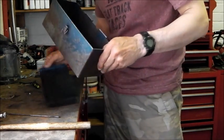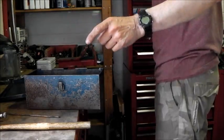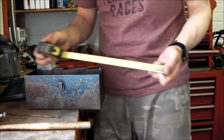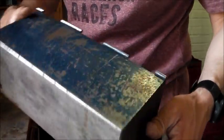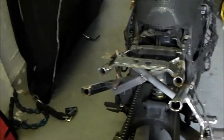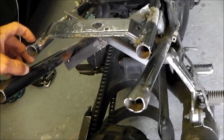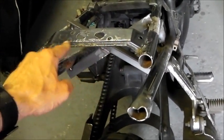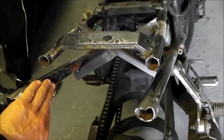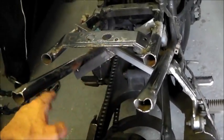Now it's going to be as wide as the frame rails, so I'm measuring and marking — scribing a proper line around it. The problem is the frame rails here are tapered. It's going to go between the bottom ones because the top two are going to be locked off level, with the box going up against that as its front support and tack welded across the front for strength. So it goes between these two bottom rails, which will be the support bars with a little bar underneath to hold them.